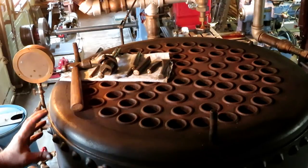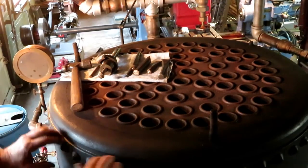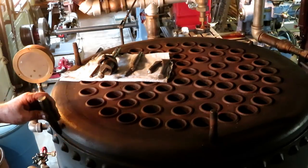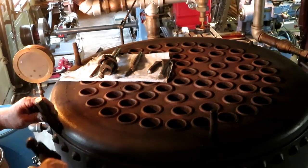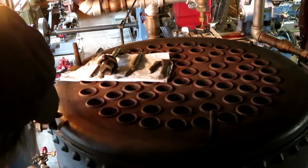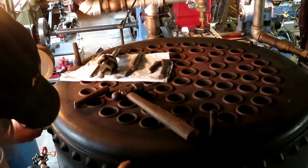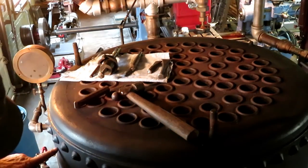And another thing that was done, I'm kind of in my own light here, was caulking. After these boilers were riveted together, they were caulked. I had some questions on how did they seal them, which is an amazing thing to me, but they did. And they used a kind of a blunt chisel like this, and it would come over here at the right angle, just about in the middle of this sheet or the boiler shell, and go around it. And you can see on this, there is a recessed area in here. And what that does is, and you hold it just right, it expands the edge of the material into intimate contact with this, which is very carefully pressed. And a lip comes way down here below the rivets.